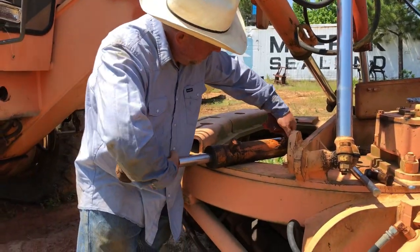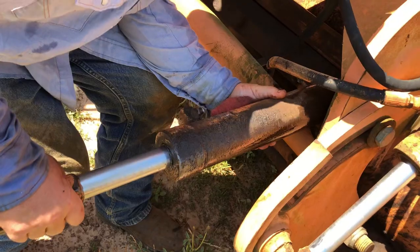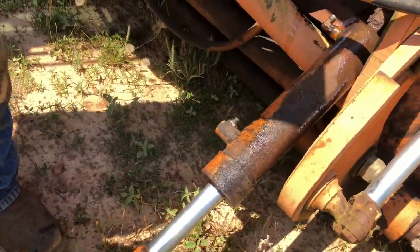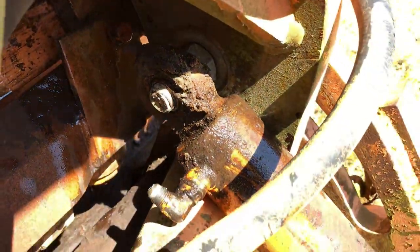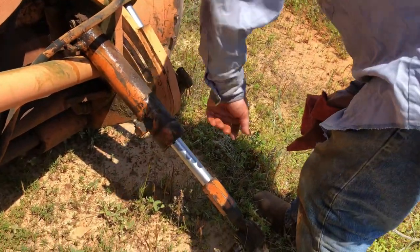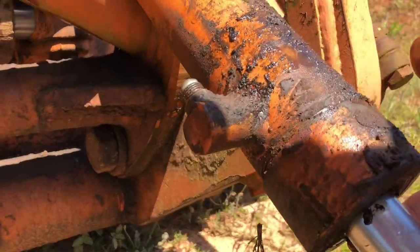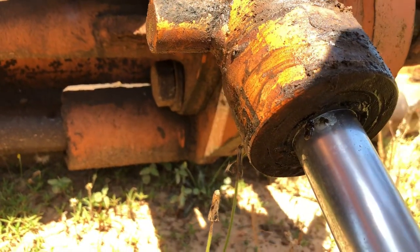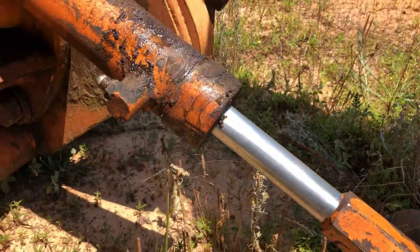But I didn't, so I look around and see, well, is there something else that could help? Here I see a long bolt, and oh, it just happens to fit through there. So now I wedged it on that bolt, and so that should hold it while I try to get a wrench on this thing and get this thing loose. So some of these use what's called a spanner wrench. This particular one, I don't see any holes for a spanner wrench. So judging from the marks on the outside of this, it looks like in the past somebody probably used a pipe wrench to get it off. So that's exactly what I'm going to do. I'm going to get a big pipe wrench and see if we can get that thing knocked free.